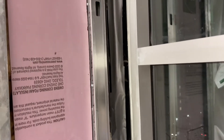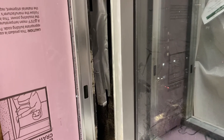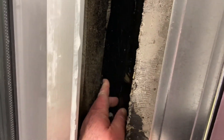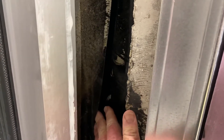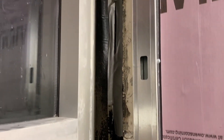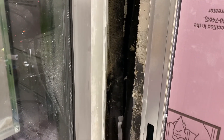You see where that duct tape is? Well, that's been sliced when they pulled out the sheetrock and other materials — we're going to bridge that gap. Here's a good example right here. See that gap right there? This polyethylene air barrier sheeting was sliced through, and that's where we're going to install the silicone sheeting. With a successful pull test, we'll be able to finish this up.